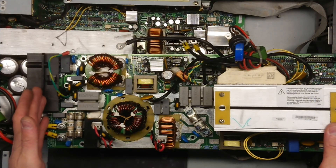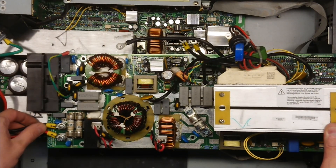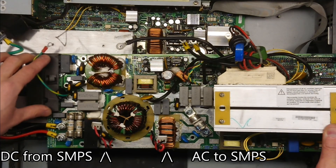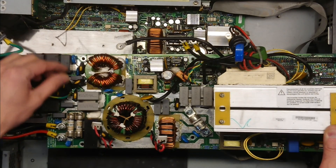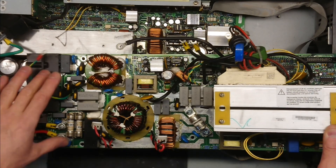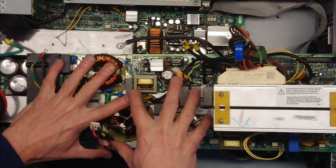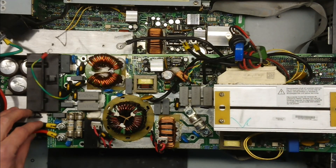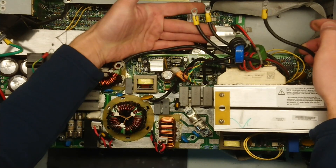The whole PFC front end is now taken out of the chassis. Over here we have a red and black wire coming in — this is the battery connection. We have the mains output and input over here. So we have regular L and C filtering sitting here on top, lots of TVS as well, and all kinds of transient protection sitting at the input — that is a lot of this board. This whole section is just output/input filtering. Getting over to the active part here, the PFC front end. These three cables connect over to the main inverter board.